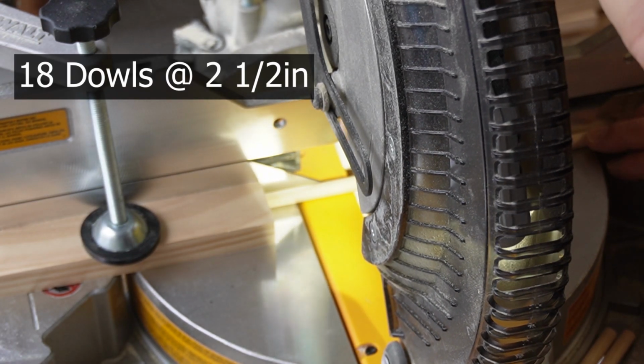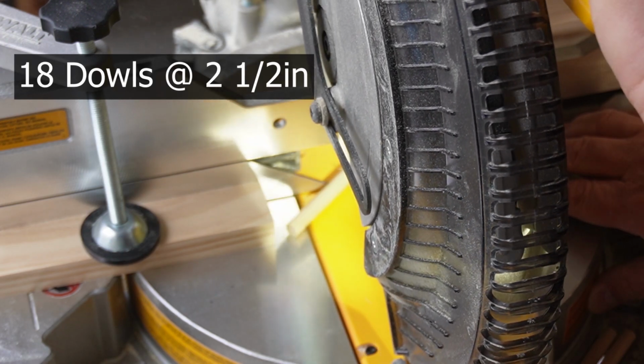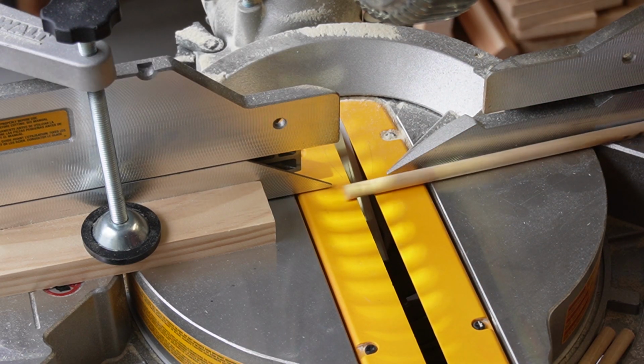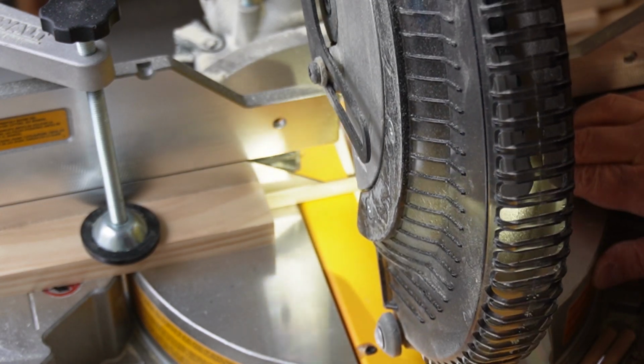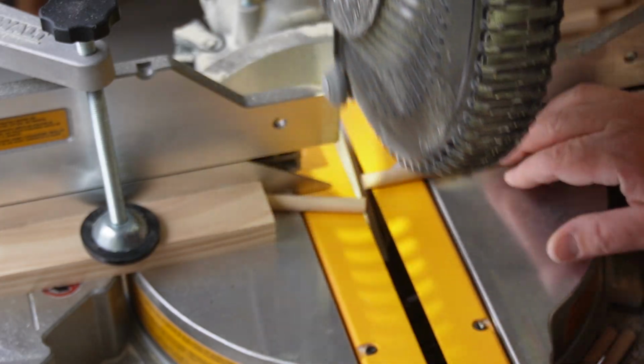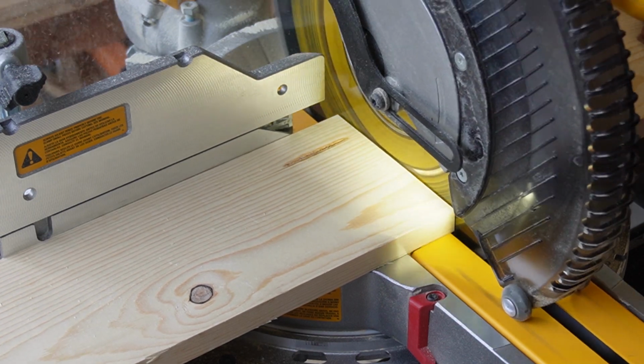Okay, so now you need 18 dowels at 2.5 inches. I know I just said the only tools you needed were a drill and a jigsaw, and now here I am using a miter saw. It's way overkill. You could easily cut these with a handsaw. And if you don't have a handsaw, I will put a link in the description to a good knitting channel you can check out. Now just cut your 1x6 down to 23 inches.